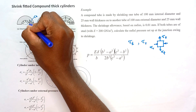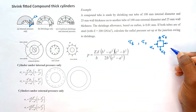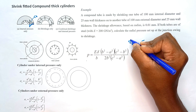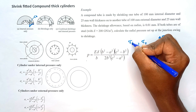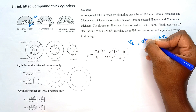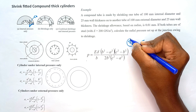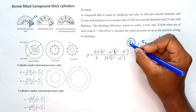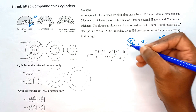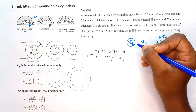The radial stress sigma-r is negative. At the inner surface, sigma-t is maximized and this value is always greater than sigma-r. So sigma-t is the critical stress — it is the principal stress developed at the inner surface. If sigma-t can somehow be minimized, the cylinder can take higher internal pressure.